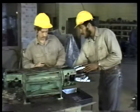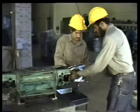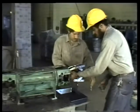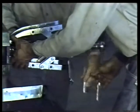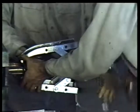When both gear pullers are in position, each of you can attach a socket wrench to the spindle of one of the pullers and begin backing off the gears. It's important to pull the gears off evenly. This requires coordinating your movements so that the gear pullers move together. Pulling the gears evenly prevents the teeth from locking or getting hung up.